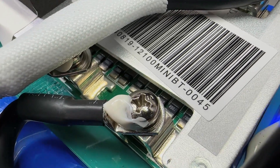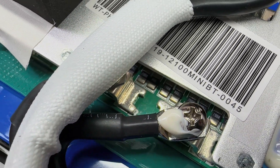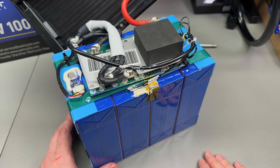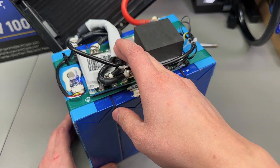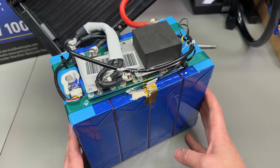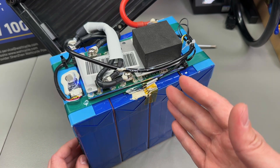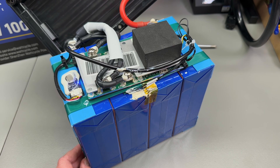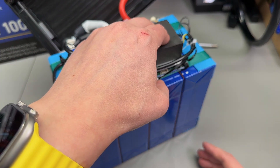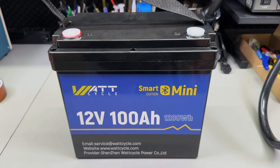Looking through the openings and examining the wiring, the BMS is doing low-side current sensing with a large number of parallel shunt resistors — that's to achieve the needed power rating for the given current. To summarize the teardown: all critical electrical connections are nicely done including welding on the battery terminals, screw mounting with silicone for the voltage sensing wires, thick silicone wiring for the main output terminals, and an O-ring on the enclosure for water and dust protection. The only complaint is the BMS zip-tie mounting, though the foam blocks make it unlikely to come apart.